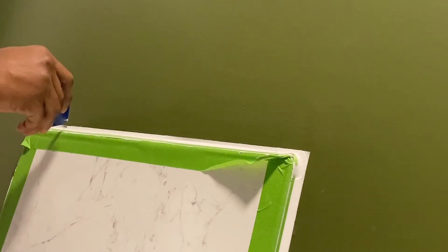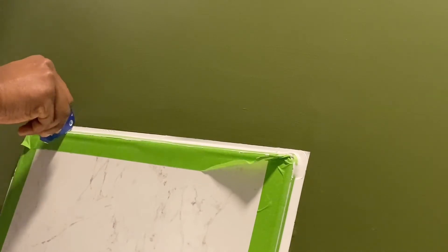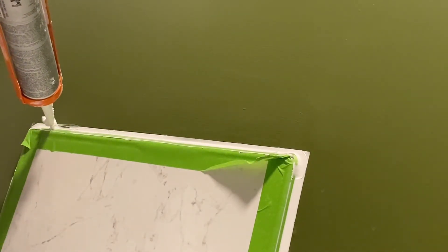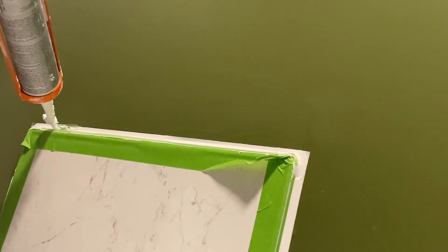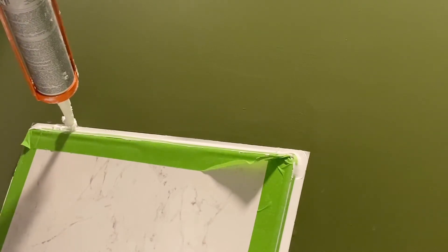Not to worry — click on the link in the description and you'll find links on how to rework the paint peeling. A quick overview: to sort it, get your painter's knife or scraper, scrape out the paint, sandpaper, prime if necessary, and give it two or three overcoats following the base coat. Just make them thin applications.